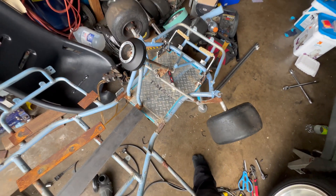The tie rods came in and unfortunately I ordered just a little too long. This is about centered right here, but as you can see both wheels are pointing inward — it still doesn't have the plate yet. I'm going to go ahead and make the plate so it actually moves, and see how much angle I'm going to get. I'll be ordering slightly shorter tie rods. These are currently 295s and they almost were right — the steering is straight but the wheel turns in just a little bit. Once I add the angle plate, I can get max angle out of the wheel, but unfortunately because the tie rods are too long, neither side comes in all the way. Once I get those shorter tie rods, I should be set.